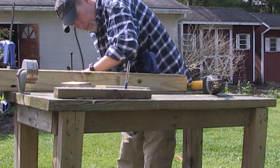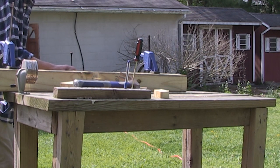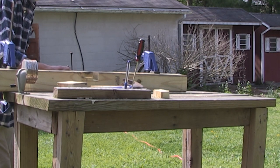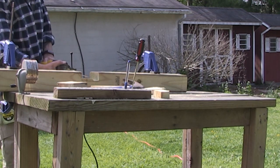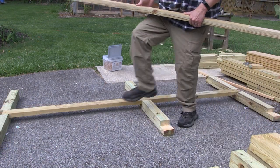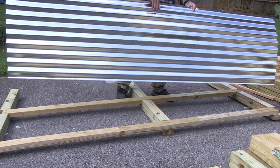Normally once you get a few clicks in there, it pops right out. Once I've got that smaller part removed, that gives me the ability to put my reciprocating saw down in there and start cleaning out the section I've marked off to make my notches where the 2x4s will fit into. Once all the 4x4s are notched out, I lay my 2x4s into the notches and use another smaller piece of 2x4 to mark the ends, then I screw those into the 4x4s.